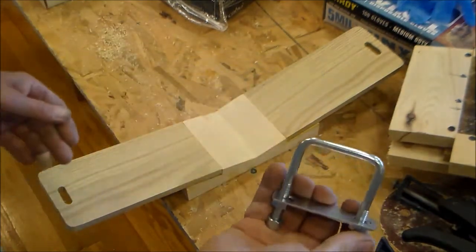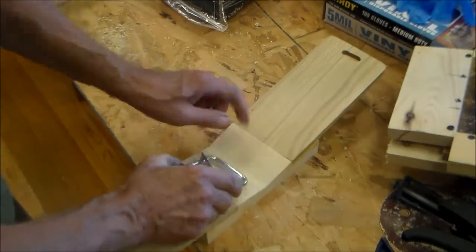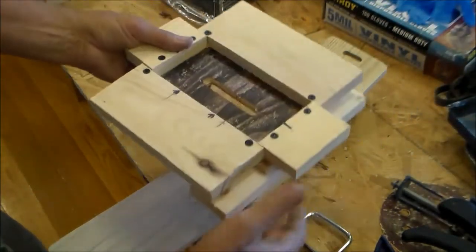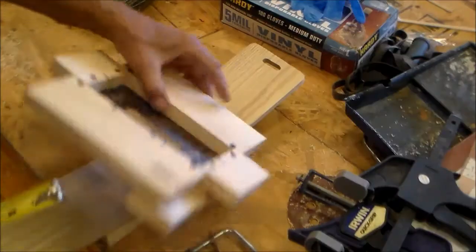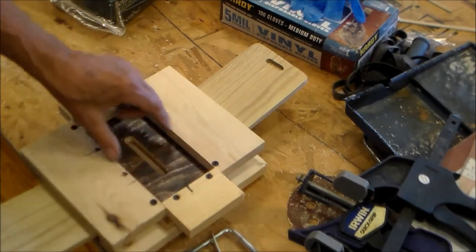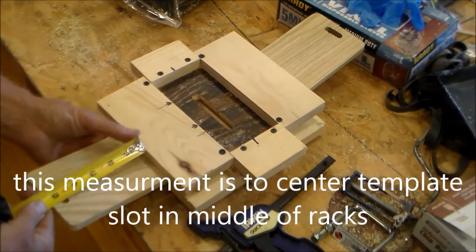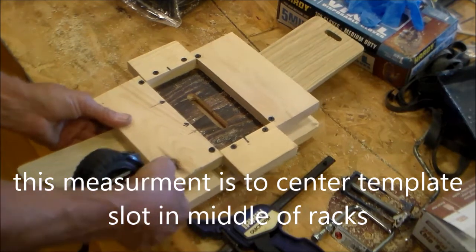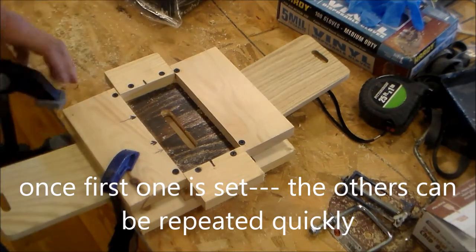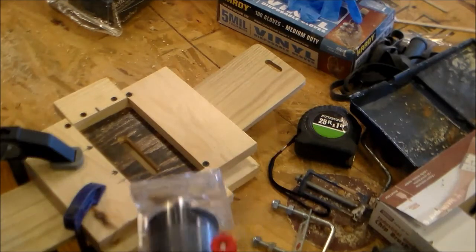I'm going to use this U-bolt to go through here and hold this down onto the roof rack. And what I want to do is countersink this top part right in this area. So I threw together a quick jig. This will go on here. I have a stop here, so it'll locate it close to the center. Slot for the router will ride in here, and I just need to measure this. I'm using a round-over bit.